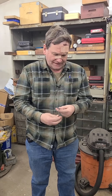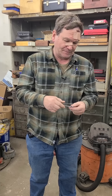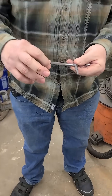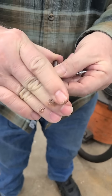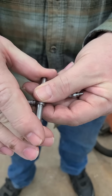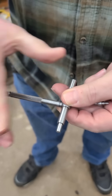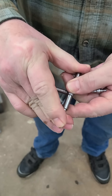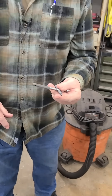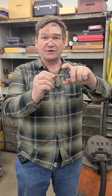Telescoping gauges. When you first work with these, quality ones really do make a difference. The way this works, you've got a friction adjustment on the back. You tighten that up a little bit and then wherever they push into, they stay. That was not tight enough, obviously, or it would have stayed, so that means you need to tighten it a little bit more. Also, if you move them through over a long range they will tend to get loose. You want to adjust them somewhere close to where you're going to go to start with.